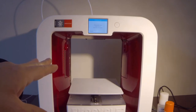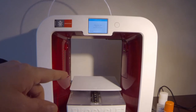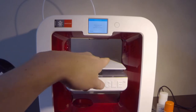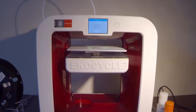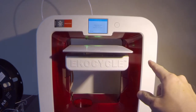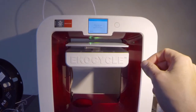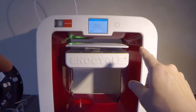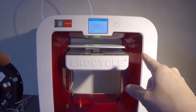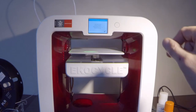The auto level routine is very good. As mentioned in another video, if you auto level and then notice that one of your corners tends to have a little bit of lift, you can adjust pads 2 and 3 a little bit. Loosen up the grub screw, give them a half a turn each, run the auto level again. When it tells you to correct those two pads, in general it lands on true. Oh, look at this, I have to adjust this.